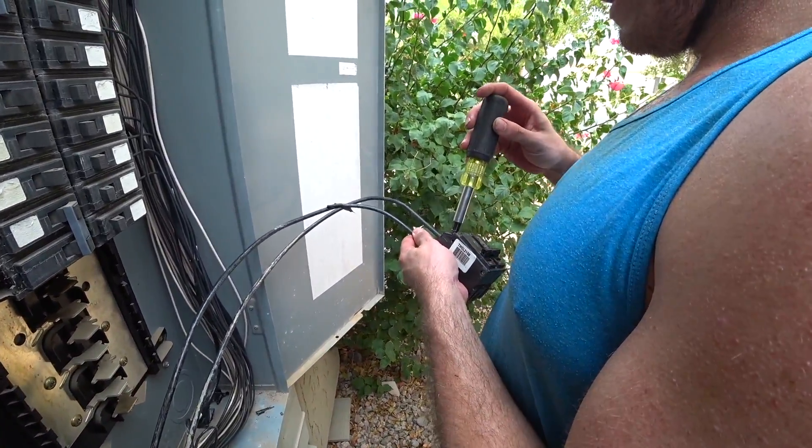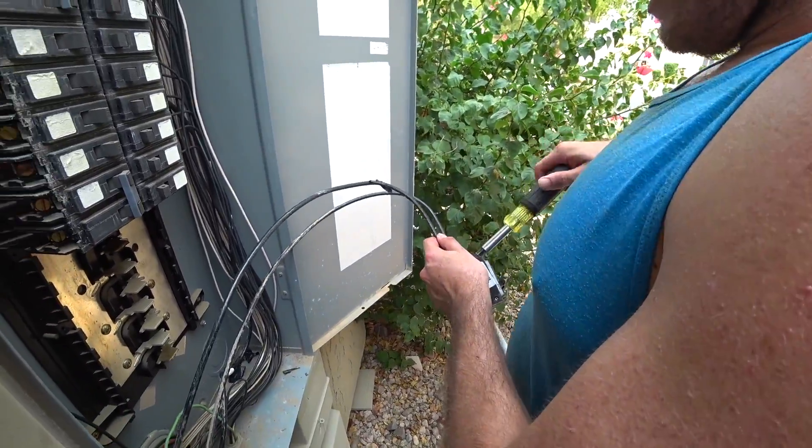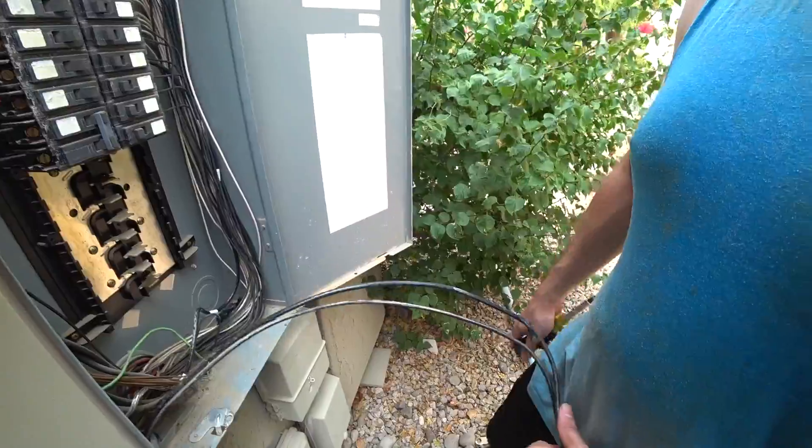Make sure whatever Tesla you have, you read the specs. We were going to cut it closer with a 40-amp, but when you send me the specs it said 50, so make sure you put it on what they say — do what they say. A lot of that is just for safety. They're going to overwork it because there's always the possibility of a storm or a surge. What they're trying to do is have the wire able to sustain a surge, but they want this breaker to trip first. So this is your first line of protection, and then that plug will also have protection, and then somewhere in the Tesla there's another layer of protection.